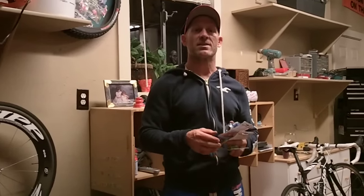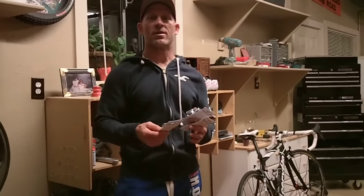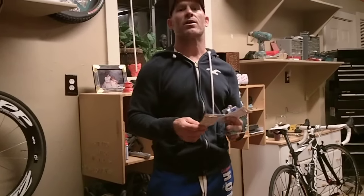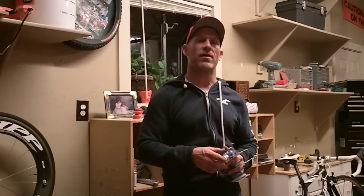In standard conditions, if it's a small house — 1,500 square feet or less — I typically use around a 517 tip. For larger homes, like 3,000 square foot two-story homes, I use a 621 because I can move a lot quicker, put out a lot more paint, and get a lot more coverage. You'll use a little more paint, but the job goes a lot faster.